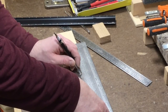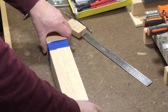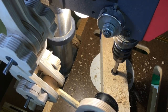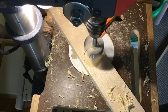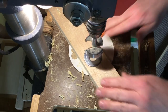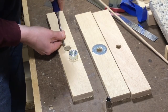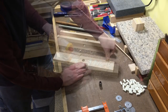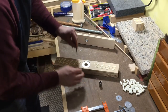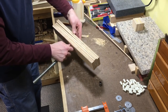Now that I've fixed the structural problems with my table I can go on to building the carriage that travels back and forth on the lead screw. This carriage is made from three sheets of three quarter inch plywood that I'll glue together after I embed a nut and a washer in them to make it stronger. A center hole that will accommodate the lead screw goes all the way through all three parts, and then in one of the boards I use a Forstner bit to make a shallow indentation that my large washer will fit into. This gives it extra support for when the nut pulls against it — it's not pulling against wood but against the steel of the washer, which spreads out the load. A spare piece of threaded rod through the nut and the washer will keep everything aligned while the glue is drying.